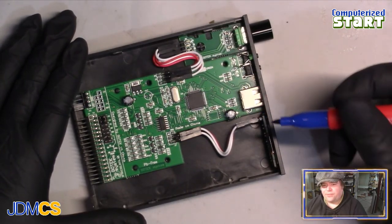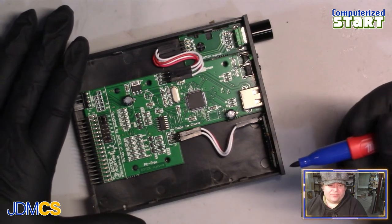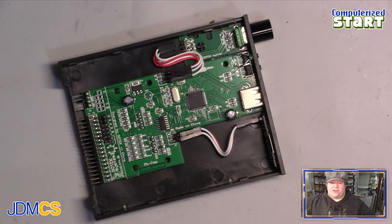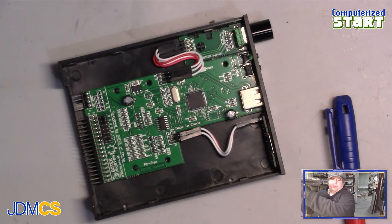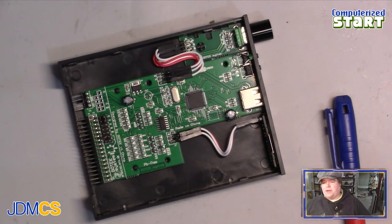If I ever got physical media for TRS-80 and I needed to archive it, then I've got a Grease Weasel and I've got 5 1/4 inch drives. I can actually take one of the 5 1/4 inch drives I pulled out of the TRS-80 Model 4P, just get the correct floppy cable. I still have the drives, and they're actually lubricated and have new drive belts and everything, because I unnecessarily did maintenance on them and then decided to replace them with Goteks. Anyways, I can take one of those original drives, take whatever floppy disk I happen to get, take my Grease Weasel, and do the archival that way.